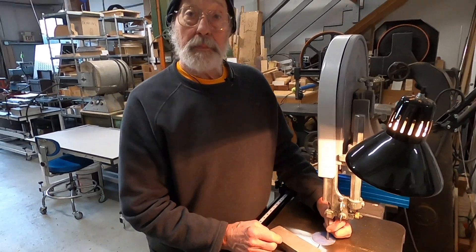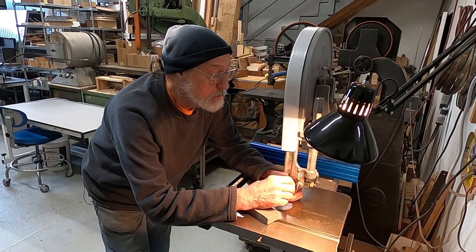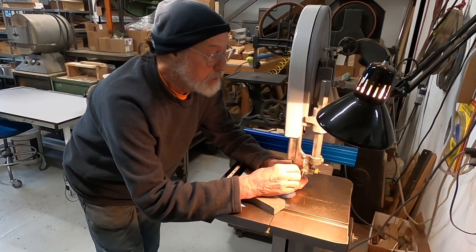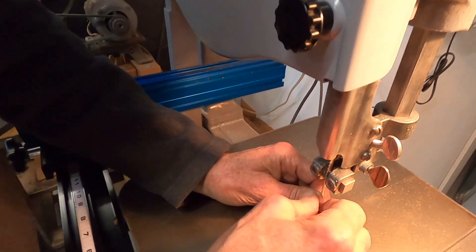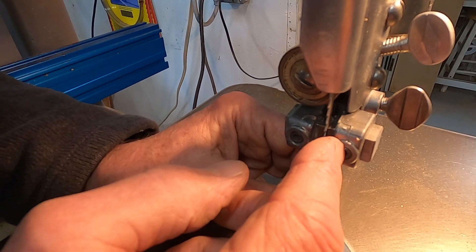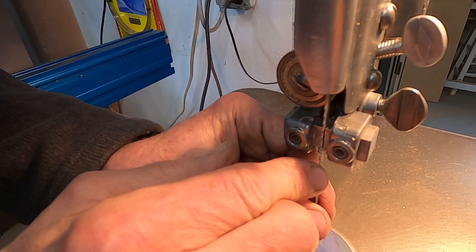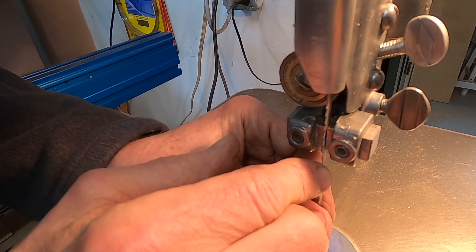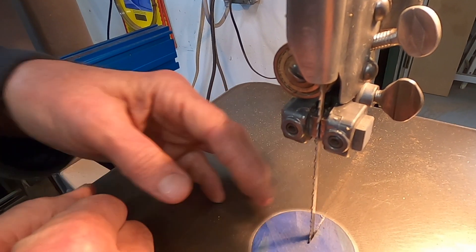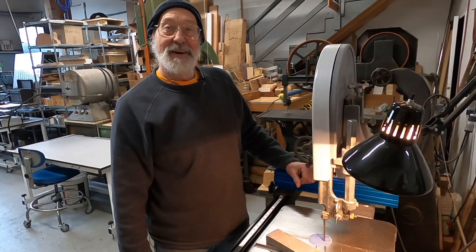So that's it — it only has to happen when you put the blade on the saw. I can see there's a little more room in the guides than I had when I first set it up, so the blade is shaking a little bit. I'll take the opportunity to loosen the guide and close that gap a little. It's really amazing how well a saw can work if everything is right — if it's running well and the blade is in good condition. These little cuts that we're taking on it really help the saw do its best work. Thanks for watching.